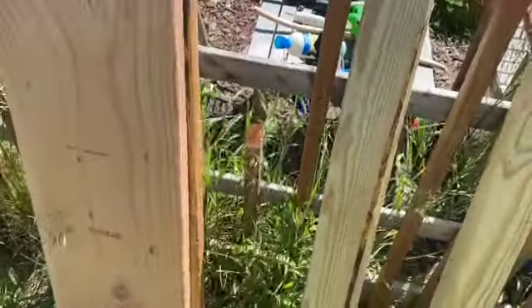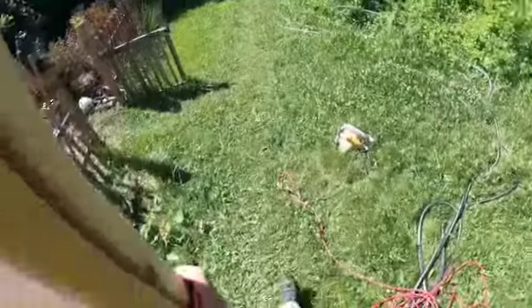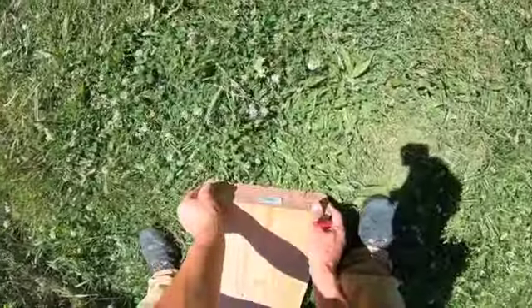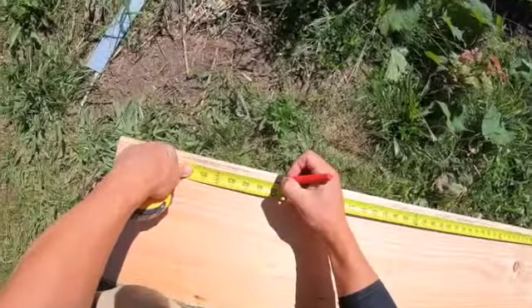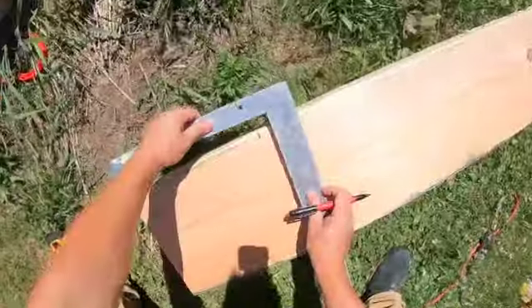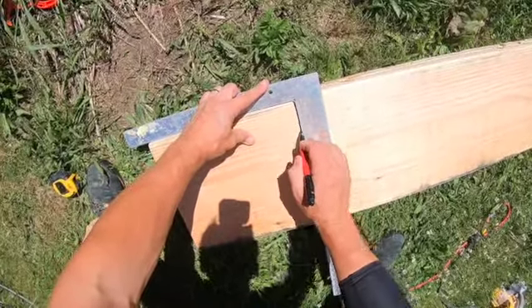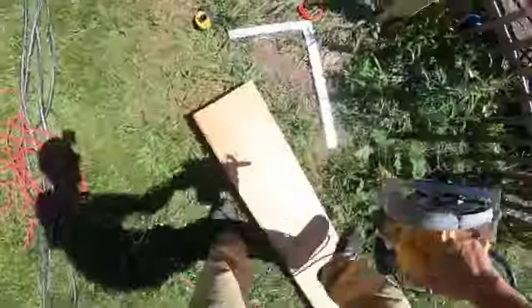You can see I've got a lot of it pre-cut already. This will be the legs — treated. I'm about to get started. Here I'm going to get the sides cut down to exactly five foot. That was the plan based on my measurements. I like to try and find a factory edge to measure from — then I know that one is pretty close to exactly straight. When I cut this at five foot, by my math it should be enough for 38 frames.